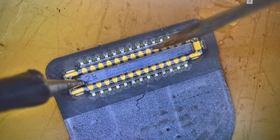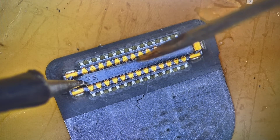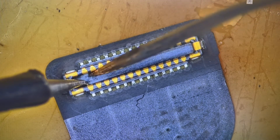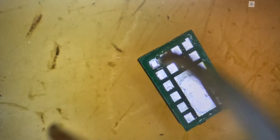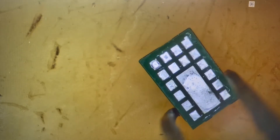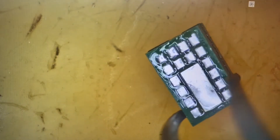Let's test real quick and see if the short is still there. Yep — you still have a short. The amount of solder left on those pads is pretty evenly distributed. On our original one, I've got one pad that seems like it has a little bit more than the rest, so I'm going to try to even that out. I don't think I'm going to need to re-ball it — it's fairly flat. I'm going to just quickly touch that up.